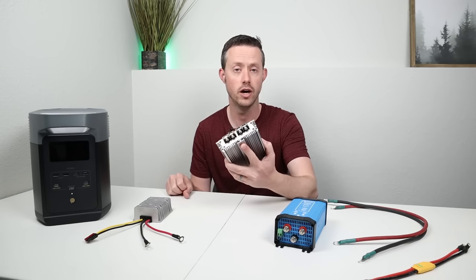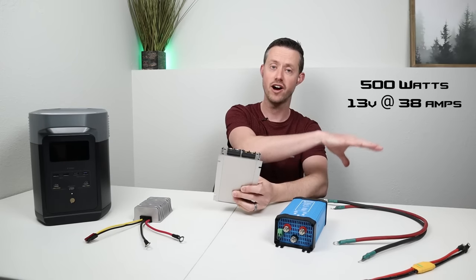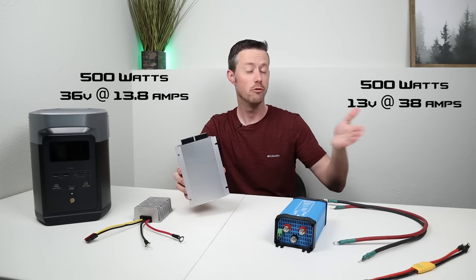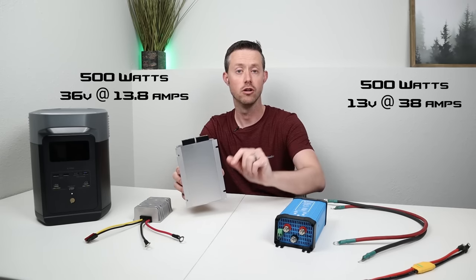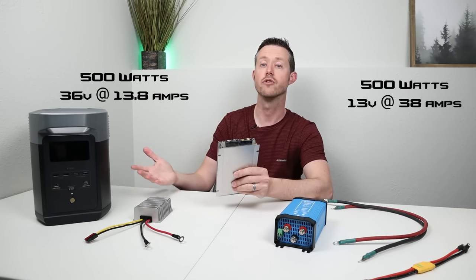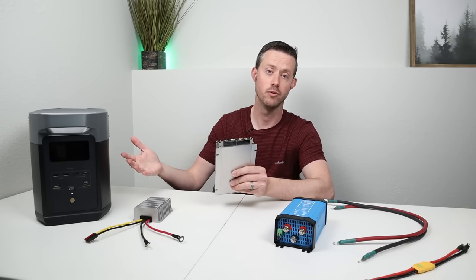Let's take the 500 watt average boost converter. We got 500 watts on the power stations, so it's pulling 500 watts from the battery and putting 500 watts out to the power station. You're going to be pulling around 40 amps from that battery, so you need to make sure your wires are a large enough gauge to handle that 40 amps continuous. Your output is going to be around 10 to 15 to maybe 20 amps, so I would recommend 10 gauge wire going out to your power station to avoid voltage drop or the wire getting warm.